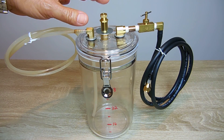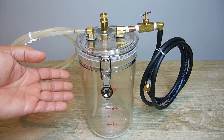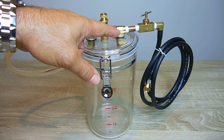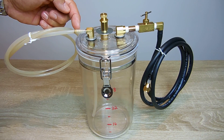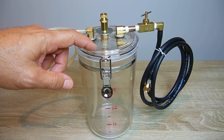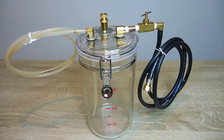Now if you choose to use this with a shop vac, you could leave the vacuum relief valve out — the vacuum cleaner is not going to draw that deep a vacuum inside this container. You're also going to have to make the side connected to the vacuum cleaner much larger: instead of eighth-inch, use around three-eighth-inch pipe fittings — a three-eighth-inch male pipe thread going in with a 90 and a barb coming out at three-eighths as well. You're going to have a male barb slide into the hose, and the other side is a male pipe fitting threading onto a PVC reducer — one side slip, the other side three-eighth-inch female threads.